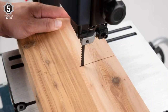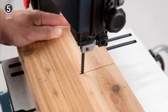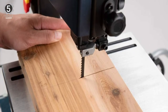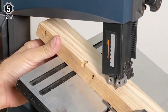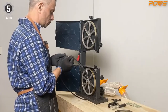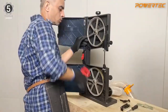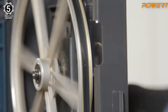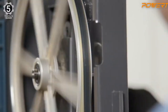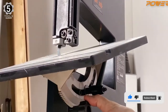The rigid aluminum die-cast table offers enough working space for performing all sorts of cutting. You can quickly adjust the rack and pinion to get a 45-degree tilt, allowing you to make angled cuts with impressive precision. The blade tracking window will ensure you are as accurate as you want. Furthermore, this unit boasts a patented blade guard system that allows quick and straightforward cutting depth adjustment, and it features a unique quick-release blade tension lever for streamlining blade changing.